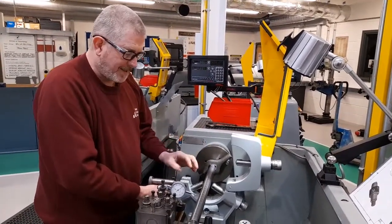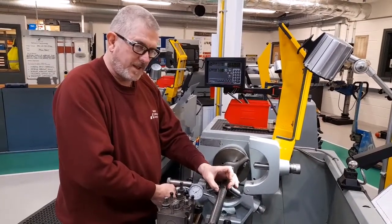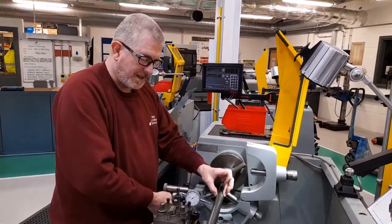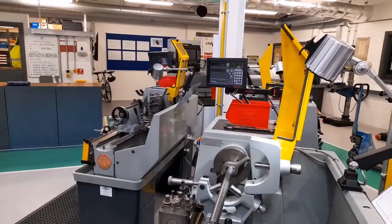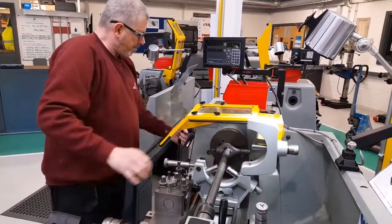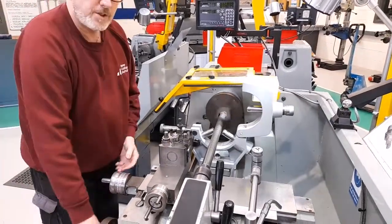What I need to do in that case is to create what is called a steady band. The steady band is a small portion of the workpiece which has been turned to make it concentric so that the roller bearings can be then applied to the steady band. I do this by using a lathe turning tool. The turning process is the same as with any other turning process.